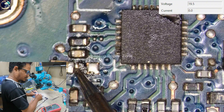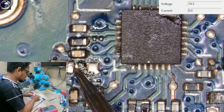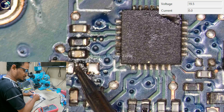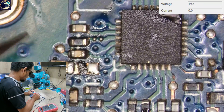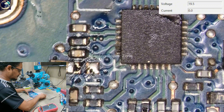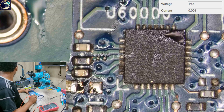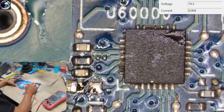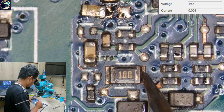Okay, as you can see, it's not fully short — maybe half short or leakage, because it's not giving any beeps; it's just showing some value on my multimeter screen. Let's plug it in again — my power supply reading is the same, nothing changed. So let's check this resistor.